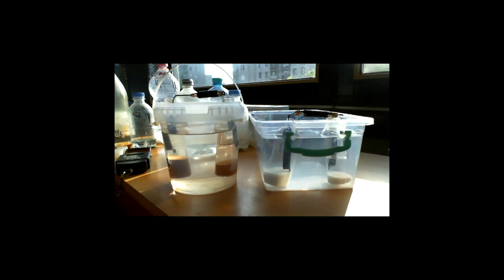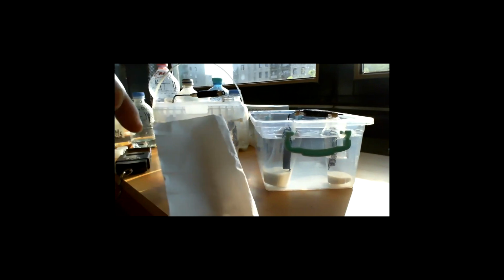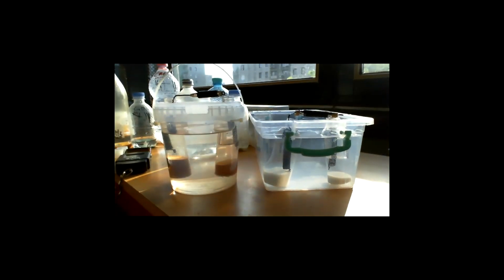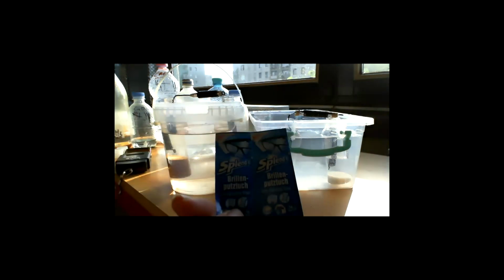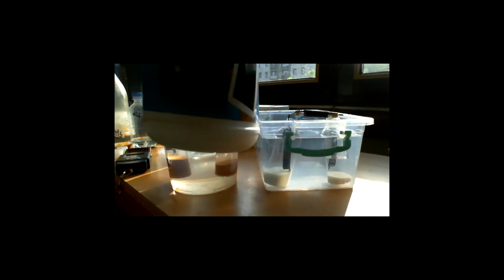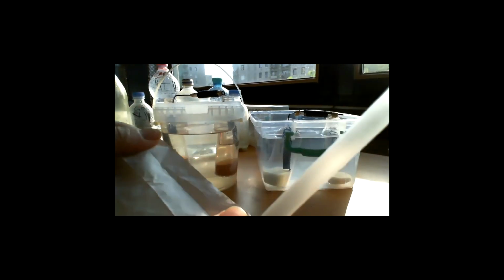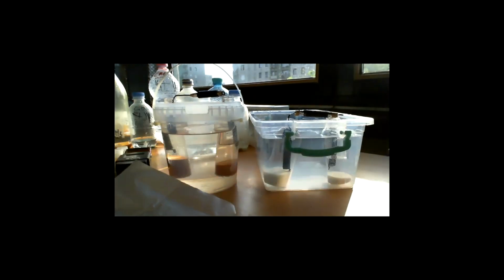Okay. For making the capacitor, I nano-coated the coil and the other part which contains the central pin. It was a very well done coating for several weeks. Then I use such kind of tissue paper. It's a hard one which is found in such cleaners for lens, or as you can find in screen wipes or computer wipes. So when this is dry, the alcohol goes off, and you see it's strong paper and very absorbent.